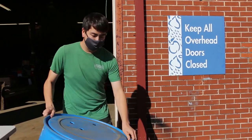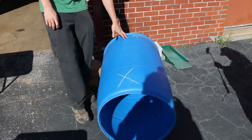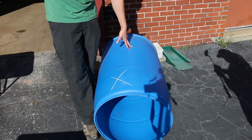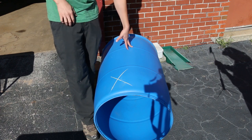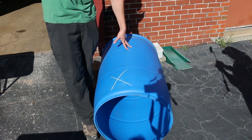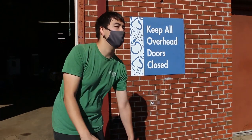Question: Is there anything you can use to increase the water pressure? Water pressure is really only a function of height — think of it like a water tower. The higher up the water is with respect to the place you're watering, the more pressure there will be. Other than that, it's an open, non-pressurized system just collecting water coming off your roof and going down your gutters, so you're not going to get the kind of pressure you'd get from a municipal water supply.